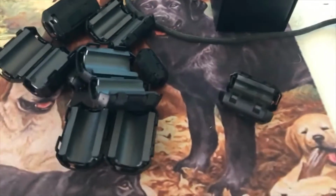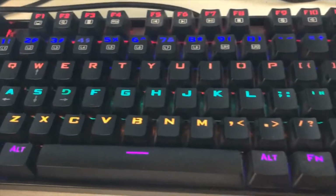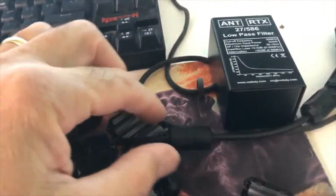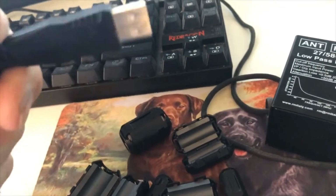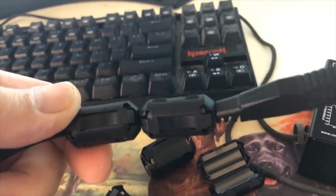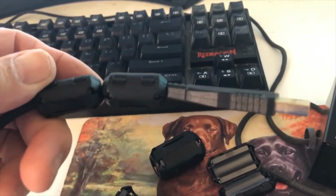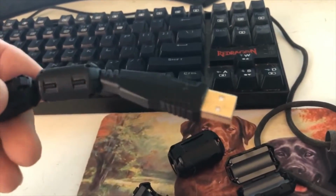Now, in my case of the computer interference, I traced it to this keyboard. My son likes to use my computer for gaming, and this computer here has all sorts of lights and puts out all sorts of RF interference. Now, I noticed it already had a ferrite bead on it, but I went ahead and I started with one as close to the input as I could. I noticed it cut it back on my radio. I put two of them on, and I don't really know. Like I said, I'm new about learning about ferrite beads, but I read somewhere where, if one doesn't work, try another one. And with two of them on, I noticed that it completely stopped the RF noise. So actually there's three of them on here. But I was very pleased with that. I got rid of the source of the RF noise from my computer.